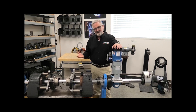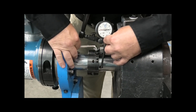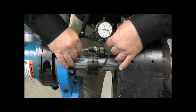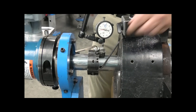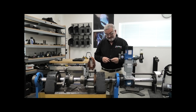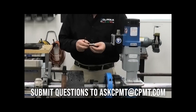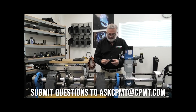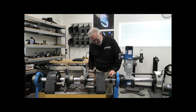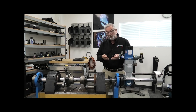Now I'm going to set up a dial indicator and show you the beauty of the ability to set this tool. One of the other nice options about this boring head is it allows us to use a variety of tooling. I have an inserted tool holder and also a brazed carbide. The same thing applies — I can use a longer tool, line it up over a tool slot, go ahead and make the placement, clamp it into the boring head and then clamp it into the boring bar, and now I have the ability to use carbide inserts with the boring head.